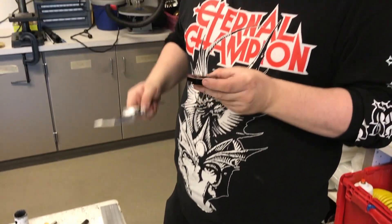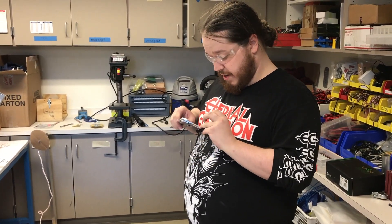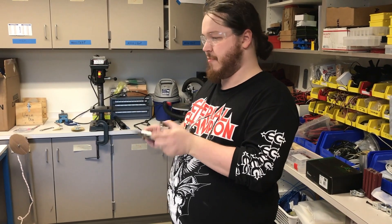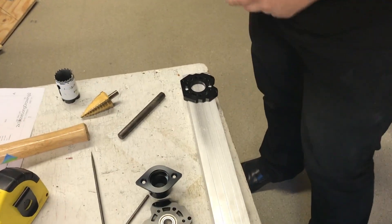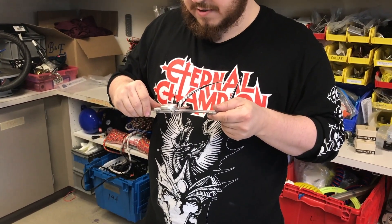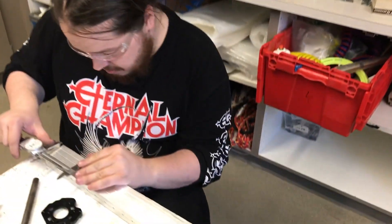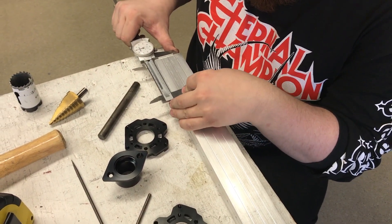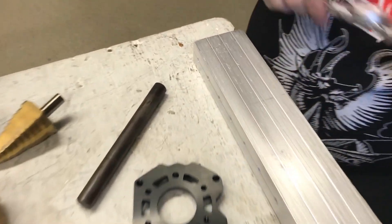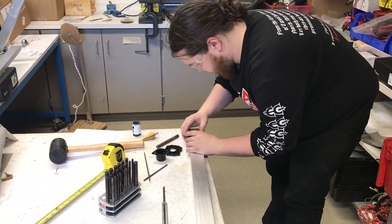So I'm just going to quickly check which is which. I'll loosen my calipers here. This edge is a little under .7, this edge is considerably shorter — so if I want the bottom, I want it facing down like this. But first I need to scribe that three and a half inch line again. I'm going to take my calipers back to three and a half inches. This three and a half inch mark is purely specific to our robot — make sure you set your own dimensions for where you want the center of your wheels to be. This one's not the factory edge, it's a little bit harder. Scribe across the center, then take this so I can line it up with that scribe mark in the drop configuration.